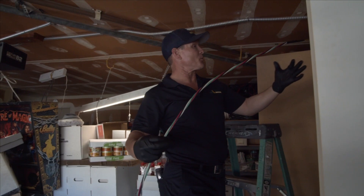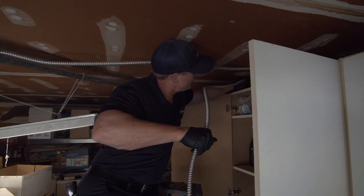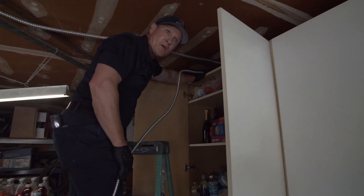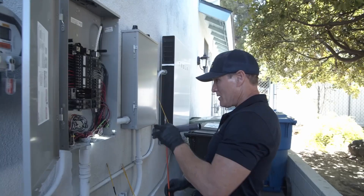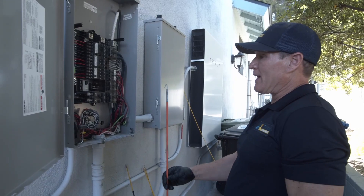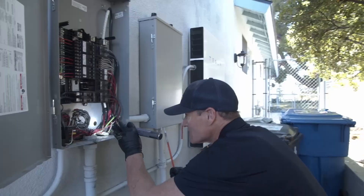We've connected the MC cable to our fish cable. Josh is going to go ahead and pull it down. You don't want to force it - just keep even pressure, because if you push it down it'll coil up. We were unsuccessful with the fish wire, so we're going to use this hook and try to get it into that wall bay. Then I'm going to try to look for it through the knockout hole and do a little fishing. This is a bit of a challenge while we're waiting for the water heater to get delivered.